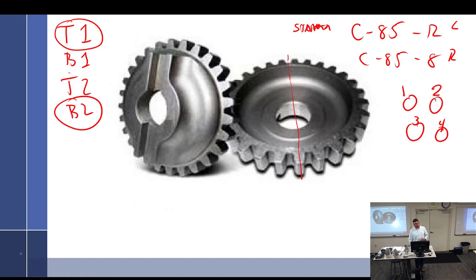If it's a left-hand rotating mag, then this is the 1, then this is the 2, this is the 3, and that's the 4. That's the order in which it's going to fire, right? So one of them's going this way, one of them's going that way. Well, when they ordered the harness, they got one for a Dash 12. And so this wire came off, and it said 1. Let me see. So we got one supposed to go left. So it's supposed to go right.